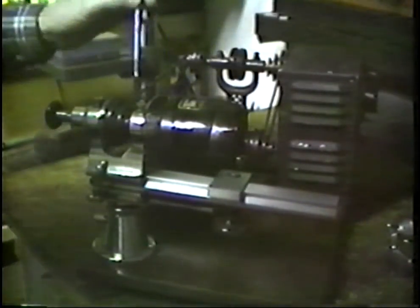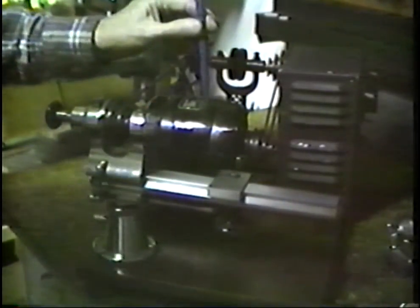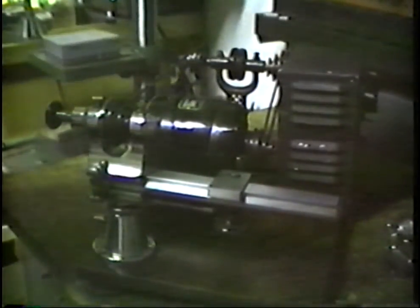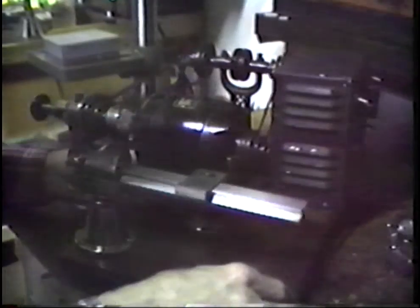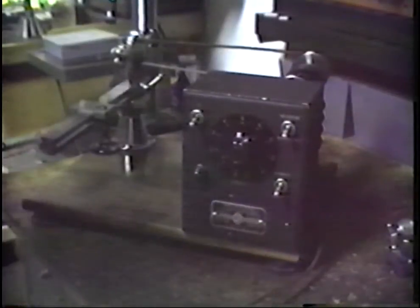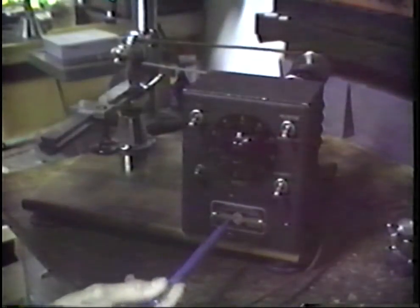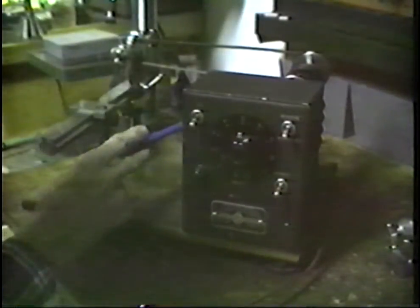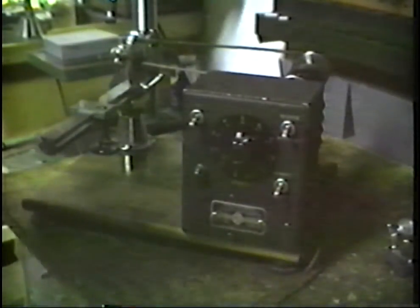If we look a little further toward the rear, right in this area, it has a 1/8 horsepower motor, and this is a variable constant speed motor. That sounds like a misnomer, but what it amounts to is that you can dial in a variable speed, and then that speed is held constant while you're in operation. That is controlled by this control unit on the backside here. This control is made by General Radio Corporation, and the motor is made by the Bodine Electric Company, both American made.